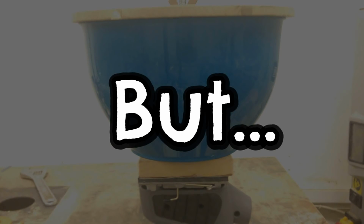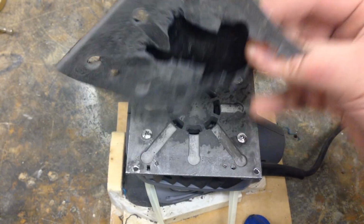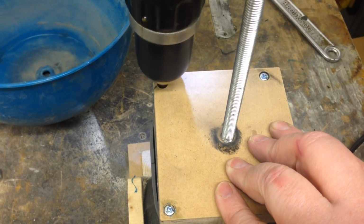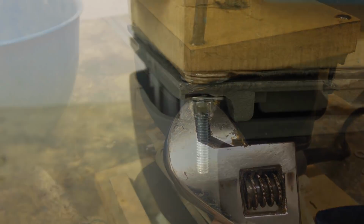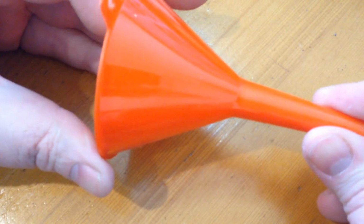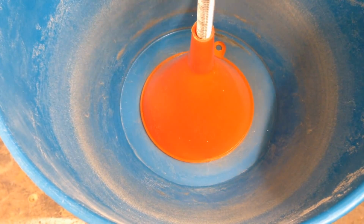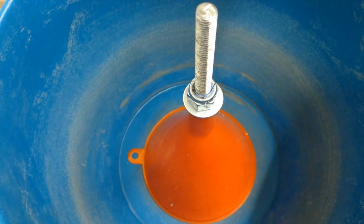After running for just half an hour, I noticed the hook and loop patch had worn free, so that spoilt the temporary fixing plan. However, drilling a few holes and adding some bolts made a much stronger connection. The tumbler seemed to be working well, but I found if I fitted a small funnel, it reduced the amount of sand I needed and seemed to help the content circulate.